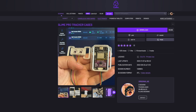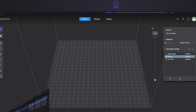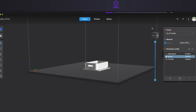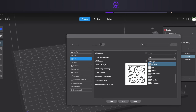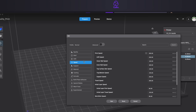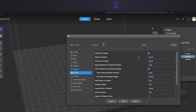So all I need now is to download cases for those trackers and drop them in Creality Print software. I'm going to use all the default settings — the default nozzle, PETG plastic, and the default normal profile. Maybe I will change infill to lightning, just for fun. All other settings I will leave default, whatever the software recommends. This is what I love about this software — it just works. I don't even need to bother changing anything. I can click slice.